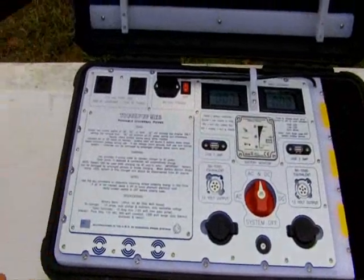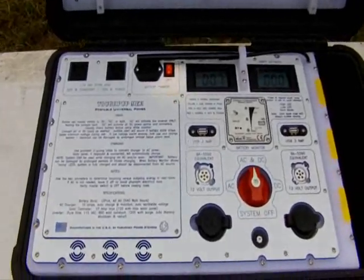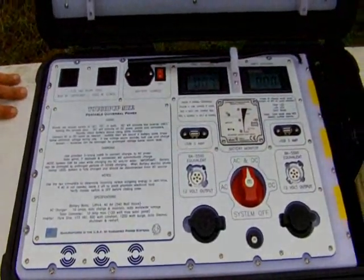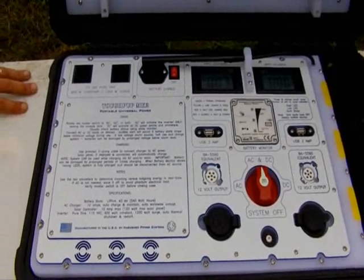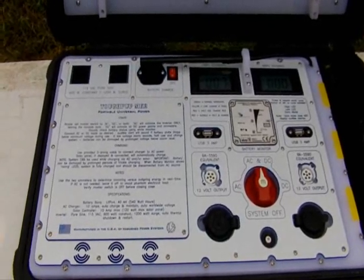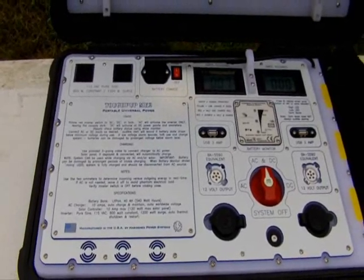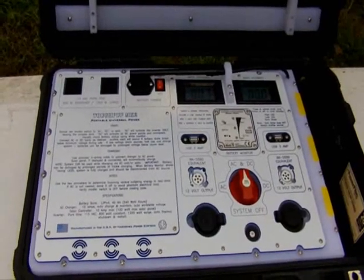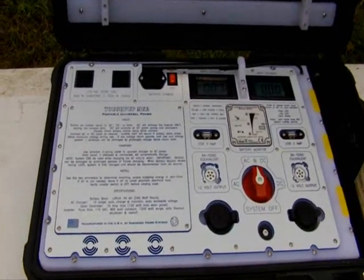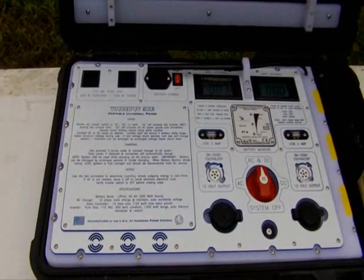This particular panel is a PowerFilm 20-watt. As I've mentioned in the video about the Juice Box Mark II, I would consider 20 watts to be a minimum for a system like this — it'll handle up to 120 watts. Considering you've got 40 amp-hours to work with, that's 540 watt-hours. If you're weekend camping and you're going to get some sun in the next day or two, you're probably going to be okay. Personally, I'd probably keep the 20-watt and then grab maybe a 60-watt and pigtail them together in case we needed more.